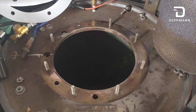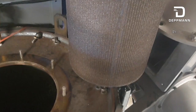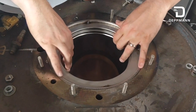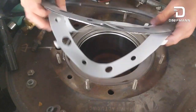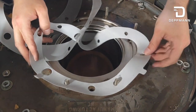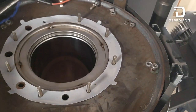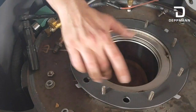We've rinsed out the tube bundle and blown out the burner with compressed air and a vacuum. The burner just drops back in place — there's a channel on the lip of the top of the heat exchanger that it sits in. Make sure it sits flush to the burner plate. Then you have your three gaskets: your lower release gasket has tabs on it so you can get it off easily next time. Then your actual foil-type gasket — make sure your larger holes line up to where the larger components are.